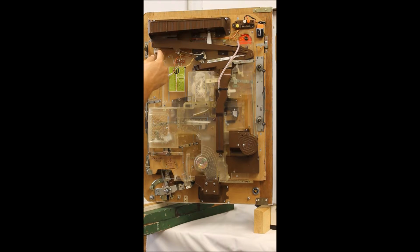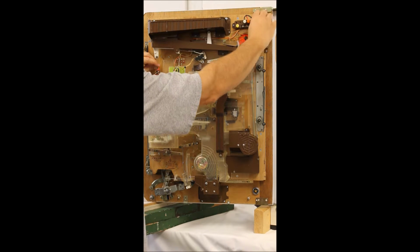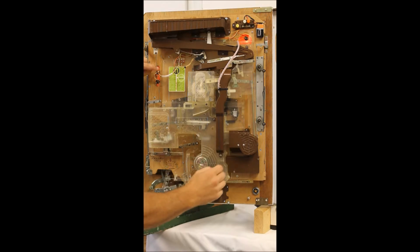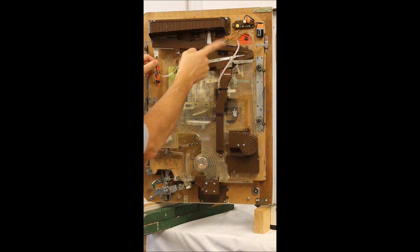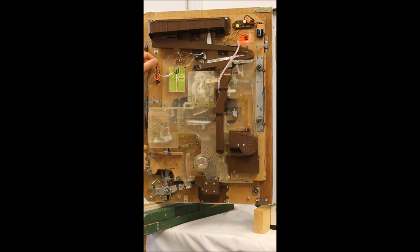The last item is the ball out mechanism here, moving up and down. When balls fill up in the tray, it pushes this down and then turns off the ball out light. Let me hook up power here, and you can see, right now it's empty, so the arm's up here, switch is on, lights on. Pull it down, lights out. This also activates the flag up in the front in the shooter area. So these are your three basic steps for setting it up.